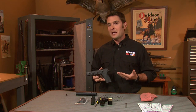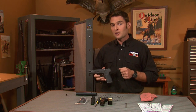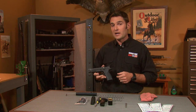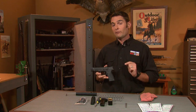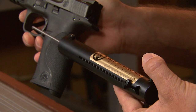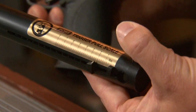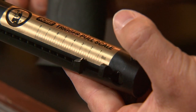First, the internal parts, all from Apex Tactical. I've got their hard sear and ultimate striker block, and those just dropped into place and got me on the way to a race-ready trigger. I also did their trigger return spring and performance striker spring. The benefit of all of these parts can be seen when you look at the trigger pull gauge — under 3 pounds. That's more than 4 pounds better than the factory trigger pull.